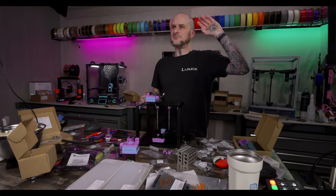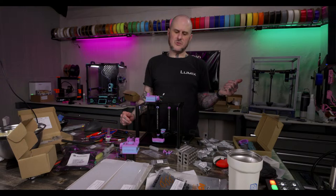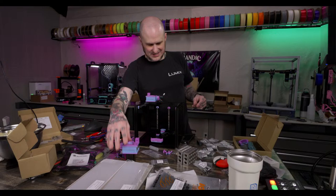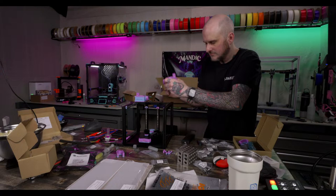Dragon High Flow. I have a Dragon High Flow in my V0.1 right now. I don't know what I'm going to do with it when I take it out of there because the Rapido is a better hot end. If you're looking at something just to fit into a Stealth Burner, the Rapido flows higher than a High Flow right out of the box, and they cost about the same. So I would recommend a Rapido over the Dragon High Flow. Okay, second side. Second verse, same as the first. Personally, that's what I would recommend, if you want to stick with a Stealth Burner, that is.